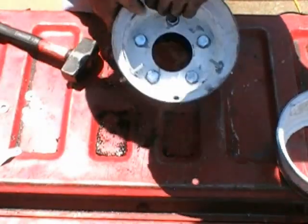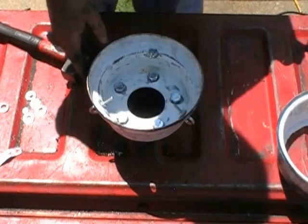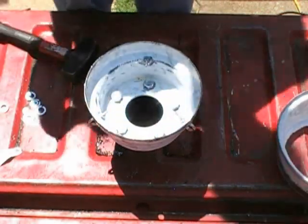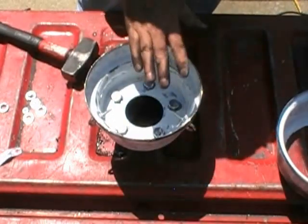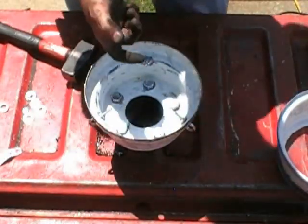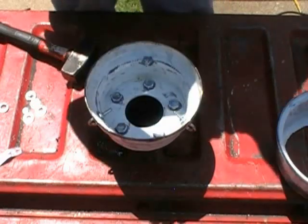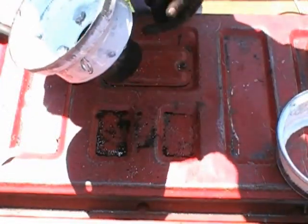So the cone sits on top of this guy right here, and actually my whole cone, the whole cone, ember bed and everything, is right at 9 inches deep. That's much deeper than what you find on your everyday gasifier. But you're not burning 9 inches of actual embers on it. You've got to keep in mind that about the first 2, 3, 4 inches, 3 inches, something like that, is going to be your red hot ember bed, and of course as it goes deeper, by the time it starts coming out of this end right here, it's already biochar, okay?